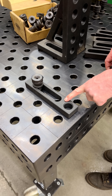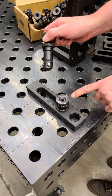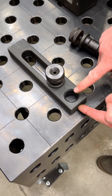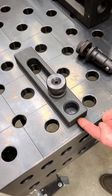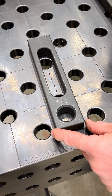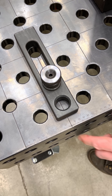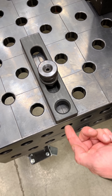In order to safely push off this design, you have to have a bolt in both locations, or up front so it pushes right into the slot — it's the only location you can put this bolt so that this block does not slide. If we want this block to be anywhere else, we lose that hard stop. You cannot be in the middle of the slot and put some pressure on it, or this sucker's going to slide.